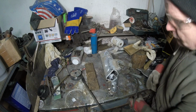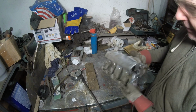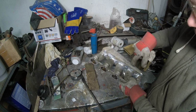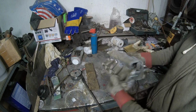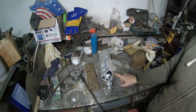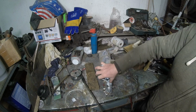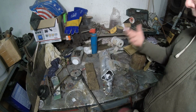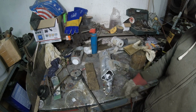Here we go. I had to really clean this one off because I had to bake the heat in it. As you can see, there was so much trash pulling out, and same thing on these things, but not bad. I just cleaned them right up, no problem. What I've got to do is take off this extra metal right here and make just a triangle plate to go inside there. Weld it in. Make another triangle plate right here and weld it in. Then we'll do the one on the back, and I think we're going to be good.